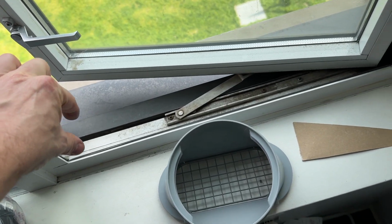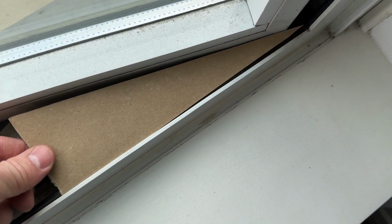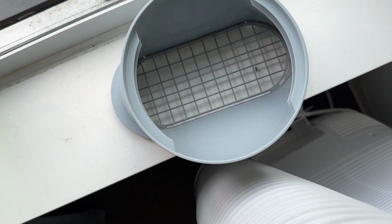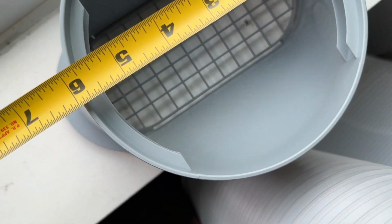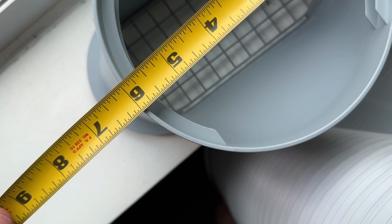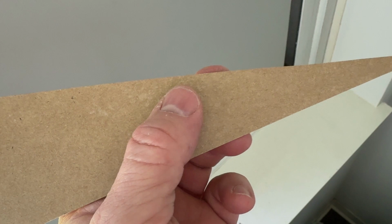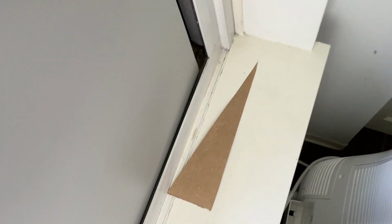So if I wanted to fabricate in a sheet of rigid foam insulation, I would kind of need to know this angle, which is exactly that angle. Just gonna have to copy it, and I need a circular hole, so I need to know this diameter figure here. Say no bigger than 6 inches, more like 5 7/8, yeah, 5 7/8 will fit this pipe through. Yeah, so cutting thick material like a rigid foam board at an angle to fit there could be avoided.